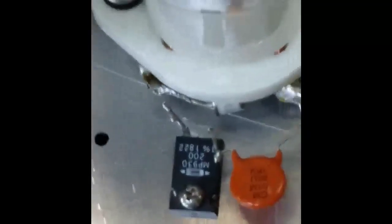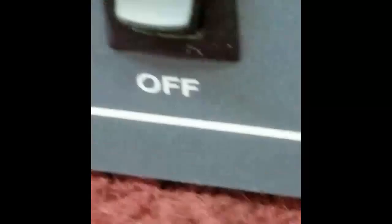Because of feedback in the amplifier from plate to filament of the tube, a little bit of swamping there helps make up for this particular amplifier not having neutralization. So what I've done now is I've lifted the ground lead of the 200-ohm resistor off of ground, and I'm going to put the cover back on and retest it.